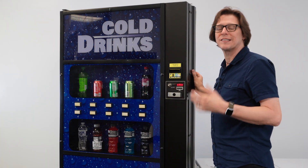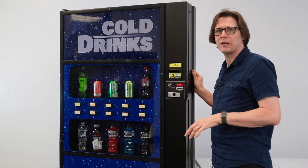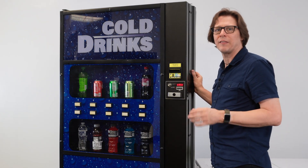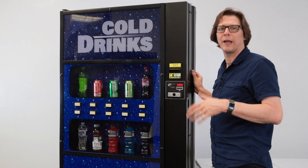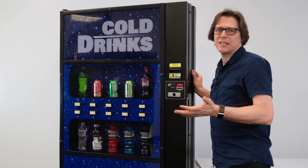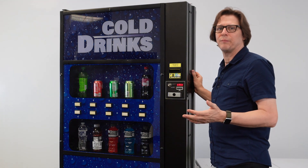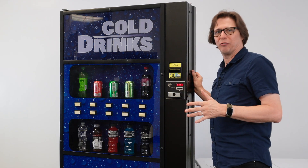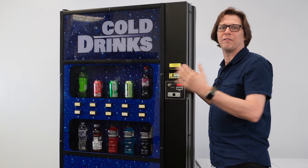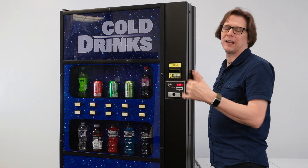What I'm looking for is TEST — T-E-S-T. Now on this display, because it's a seven-segment LED display, the T's look funny. They look like broken E's or upside-down F's — that's the only way to make a T on a seven-segment LED. People have described it to me as a funny letter, an E, a five, and a funny letter. I read that as T-E-S-T.